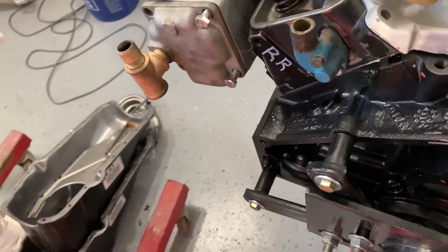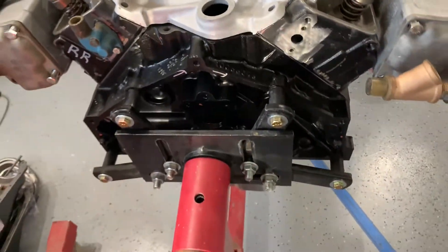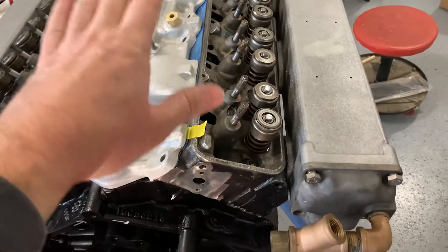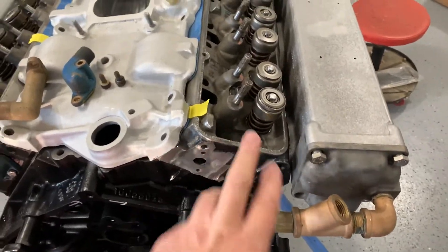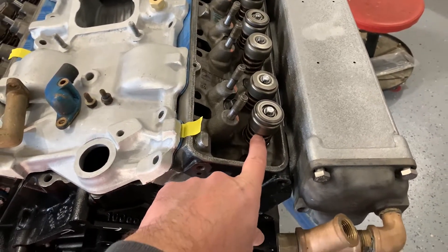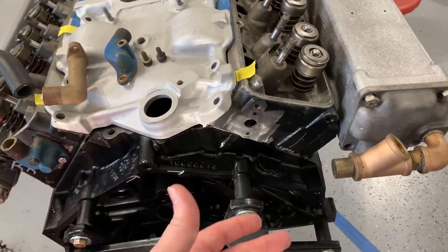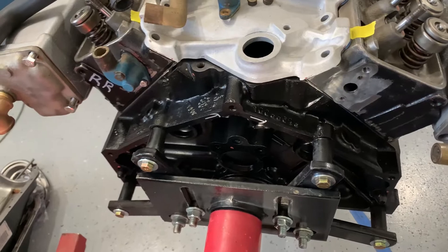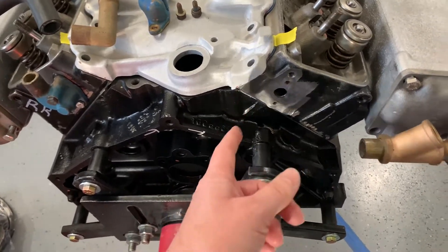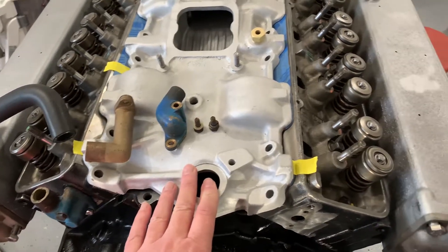The special hose for the alternator version can be sourced from Robert Hinkle at chris-craft-parts.com — that link is in the description. That's pretty much it for the head machine work. These are brand new heads, but I still had the machine shop go through them to make sure everything was 100% right. They pulled all the valves, lapped them in, put better oil seals on the valve stems, and noted that the head surface wasn't great from the factory, so they gave it a light resurface. Again, I used the Felpro 17-030 head gasket, and all the head bolts are torqued down.